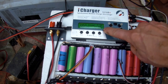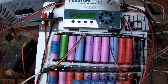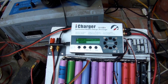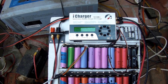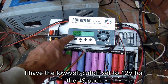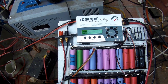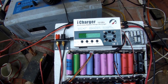The input voltage is off my solar battery bank — we're pulling about 7 amps in on the input. The solar batteries are down to about 12 volts; we're not getting a lot of sun today, it's pretty much overcast. But I'm trying to get as much charge back in as I can. It actually throttles back on the input power to stay above the low voltage cutoff. If it tried to pull 10 amps it would probably drop this below 12 volts, but it's just pulling as much current as it can while staying above the cutoff voltage.